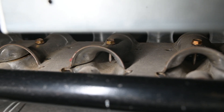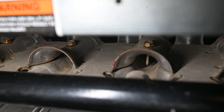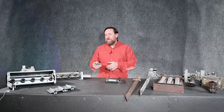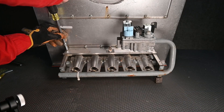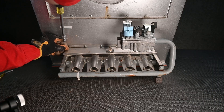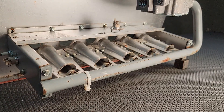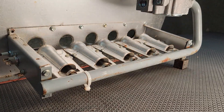We can see that there's a lot of dust in here, so we're going to use CO2, nitrogen, or a little paint brush to clean all those up. We also want to inspect the spuds and orifices to make sure those are all in really good shape. If I see rust I'm going to pull that off and use a wire brush to clean it. What I typically like to do is remove the burner cover plates to get access to the screws for the individual burners.